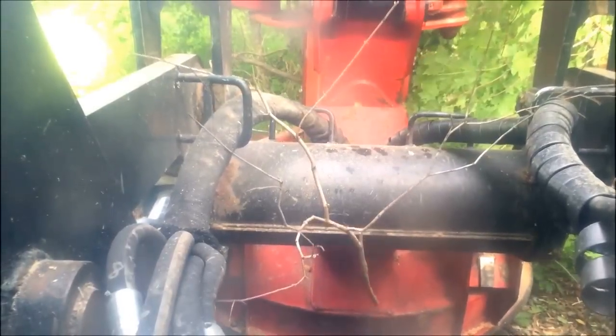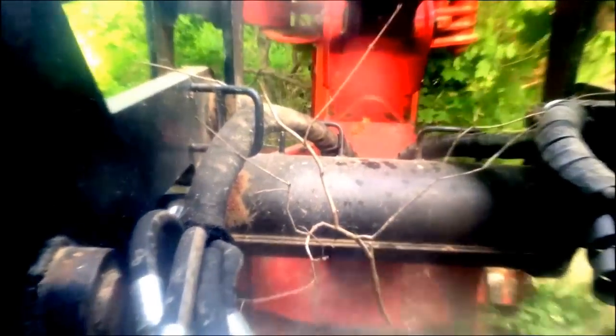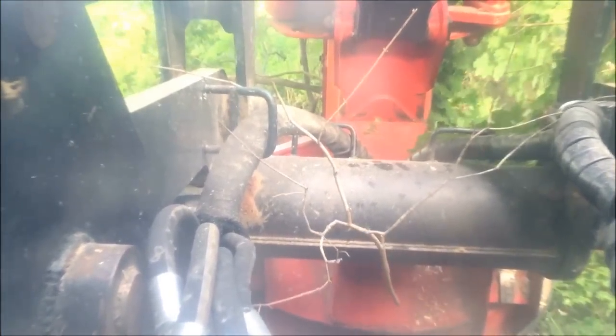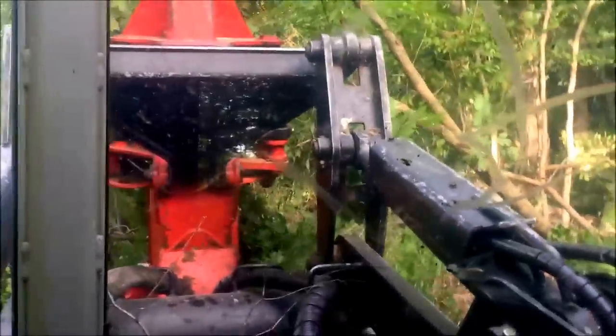Now this time I'm gonna try to get my arms to grab a little bit as I go. There, beautiful. Now wait for the rain. You cut one of these dead ash, you can expect rain down the machine, so you gotta kind of watch that, because I tore off hoses and everything else when I first started. Pee-wee was smarter than that, but I wasn't.